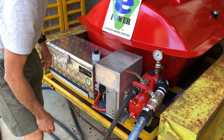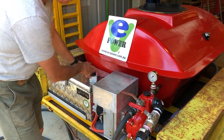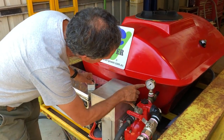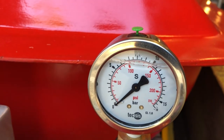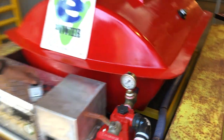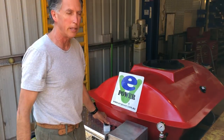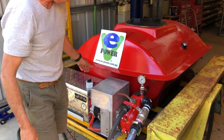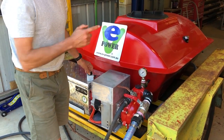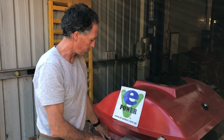Click — sounds promising. Crank up the revs. I've set it to a limit of about five bar, which is a reasonable amount of pressure for this kind of pump and hose. Much more than five bar and you start to lose efficiency, so we've set the motor revs to just that. It's going to sound noisier on the video than in real life — it's actually not that noisy, certainly not as noisy as the petrol pump.